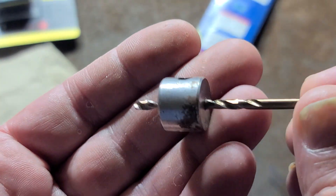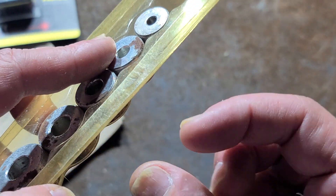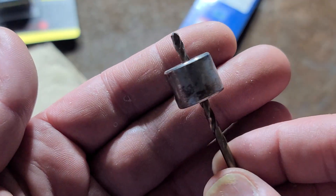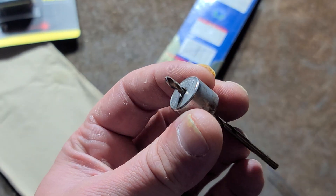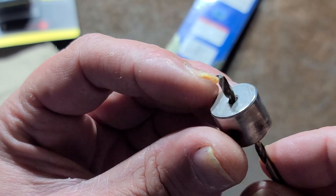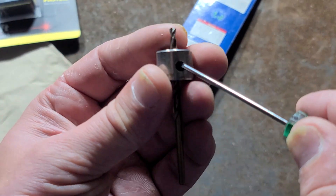The whole point of these is that you set a measurement and screw them down. So if you want to drill a bunch of repeated holes — say you're screwing something to a piece of wood from underneath using really short screws and you want to make sure you drill the pilot hole but don't go too deep — you do something like this. That way you can drill a series of holes, they'll all be at the same depth. They're just drill stops that go onto the drill bit itself. You want to be a little careful so the face doesn't damage the surface you're drilling into.